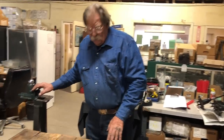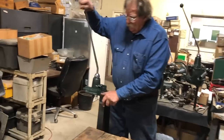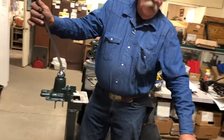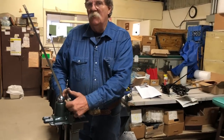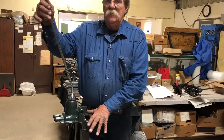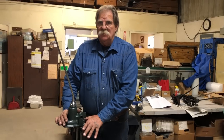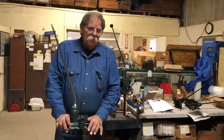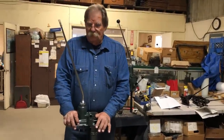In the case of this tower I built this morning, I shim them until I can't get any more detents in. This particular tower took five of these little washers that are 30 thousandths thick, so I added 150 thousandths of spring pressure. I want to come up with the most significant feature — I want them shimmed in as tight as they will go for that situation.